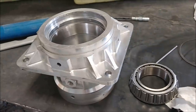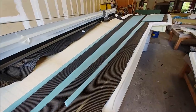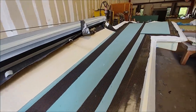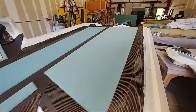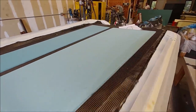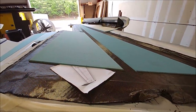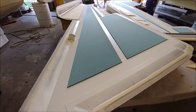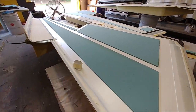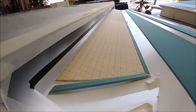Meanwhile, Jeff, Devin, and Zach were cutting core material again for the wing skins. As you can see, there's a quarter-inch core there in blue that's been cut and positioned in place — just dry fitting everything. That one's almost ready to lay up, and they're working on the other ones as well: another upper skin and a lower skin.